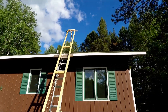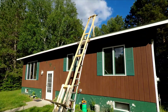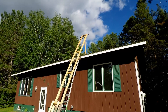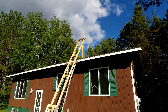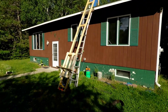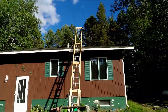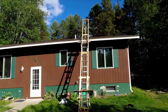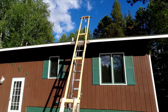You can also see I have a 2x4 at the top there, because when I tested it the first time, once the shingles got past the fascia and drip edge they wanted to cantilever out a bit. So I put that vertical 2x4 just toenailed with screws into the top there to take up the weight. Right now with the shingles on the deck, I just have a little piece of one-by underneath it so it doesn't dig into the shingles.